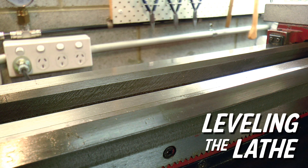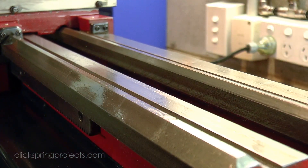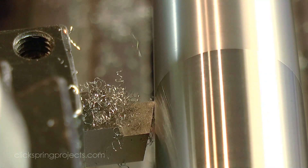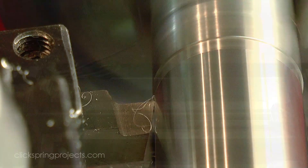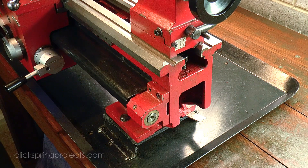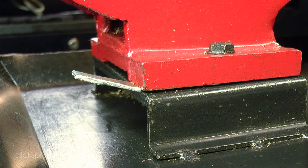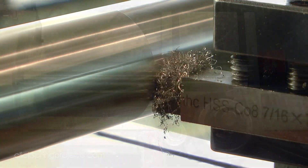One thing I haven't mentioned is how important leveling is to the lathe performance. All lathes need to be properly leveled before use, and that term is a little unfortunate, because it sounds like I'm talking about making something horizontal, when really what I'm talking about is taking the twist out of the lathe bed. Straight out of the packing crate, all of these lathes will have a light twist to the bed and so are turning some sort of taper. An alternative approach to consider for these smaller benchtop machines is to lightly shim directly underneath the feet of the bed, and then crank down on the fasteners to generate the force required to twist the bed straight. Don't be surprised if you spend a few days getting this right — it is a bit of a time consuming process.